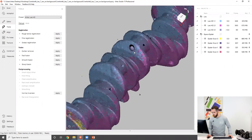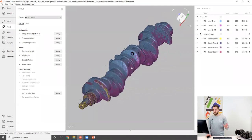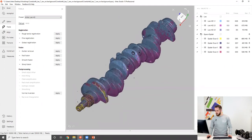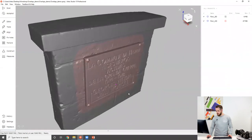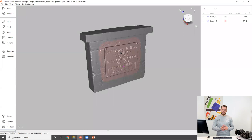Registration has been done successfully and everything looks fine. When erasing the HD region from a lower-resolution dataset, we should still leave a bit of an overlap — a narrow strip of surface between the groups of scans — to decrease the chance of geometrical defects in that transition. I have another project to demonstrate this. As some users pointed out, this step can be tricky because we don't have any means of preventing scans or fusions from the eraser tool like we do with global registration and the lock functionality. But there's a technique I'd like to show you that introduces an easier solution.